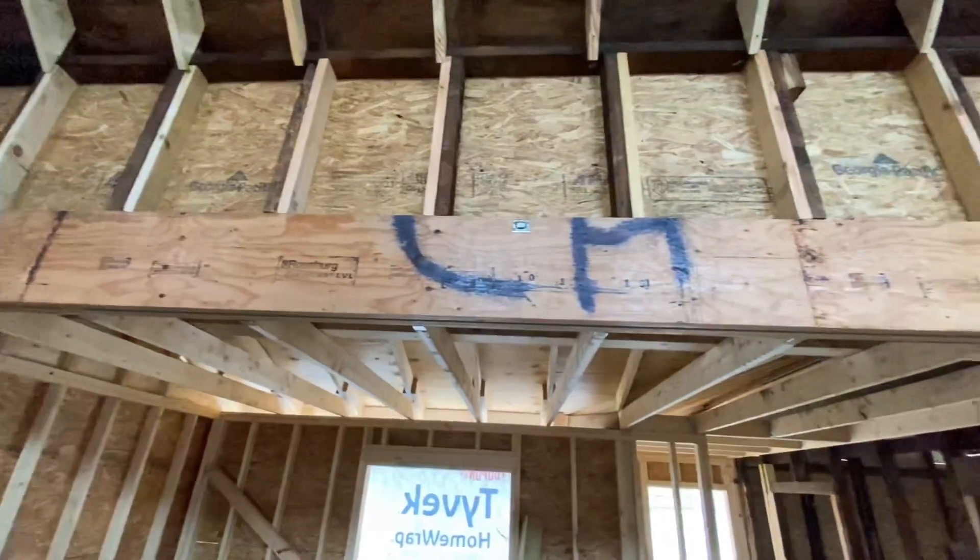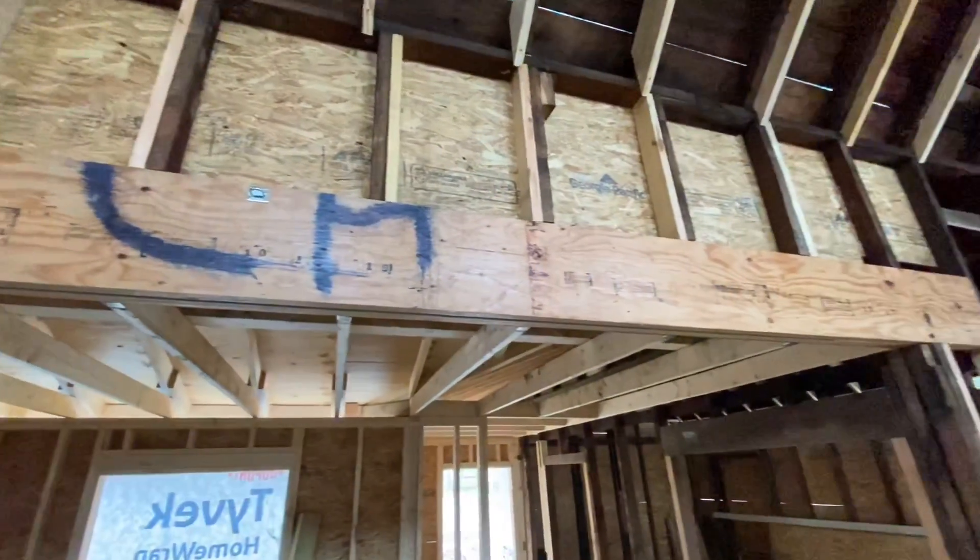This house was made up of lots of small rooms with low ceilings and no large spans over any of the openings, simply because it would have been more difficult to get lumber that would make those spans happen without sagging. In modern times it's no problem to do a large span with one of these engineered LVL beams. You can see right here behind me that we have a large span supporting a ceiling and a roof load with no problem. I bet the old carpenters were like, no way — we're not spanning more than four feet here.